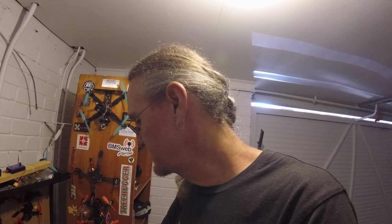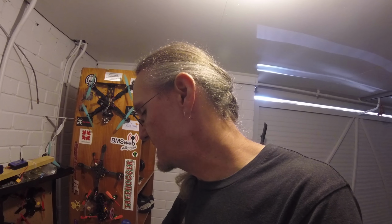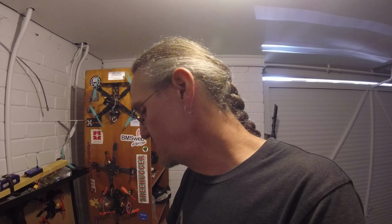And you know, your batteries can be quite different in voltage, despite what people say. It's an equilibrium reaction, so when you plug in the battery, more charge will dump all of its extra electrons into the battery with less charge until they reach the same voltage and stabilize. Now, if there's a big difference in those voltages, you'll get a lot more current flowing. It's not very nice to plug in an empty battery and a full battery, because the empty battery will get way more above its recommended C charge rating. But if they're relatively similar, it's fine.